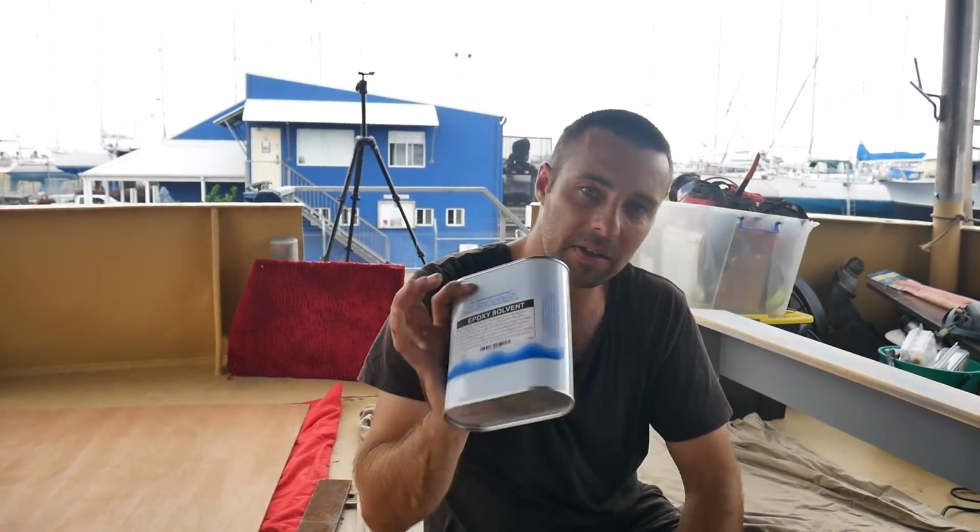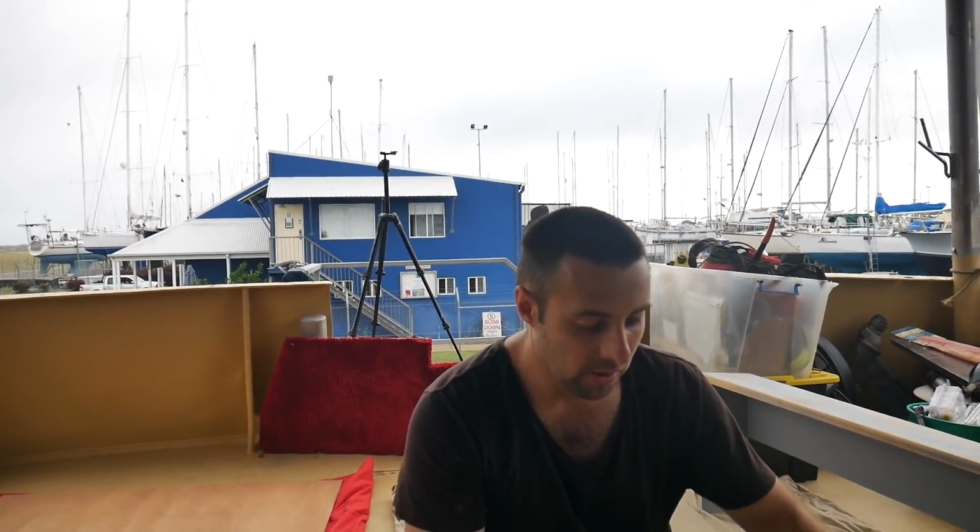This is a 5 to 1 mix, epoxy resin and then epoxy thinners. He said if you mix up your resin, let it sit for 5 minutes, and then do a 30% thin down with the epoxy thinners, you end up with essentially the same viscosity as Everdure. The only difference is you don't have the biocide that Everdure has. However, he's seen wood that's been Everdured and just epoxy resin, and there's almost no difference in terms of mold growth. So we saved ourselves about 50% by trying this, so if it works, this is awesome.